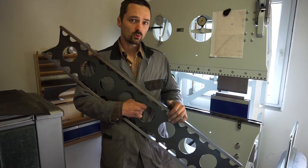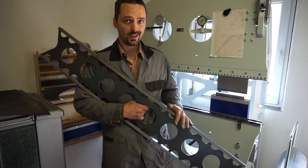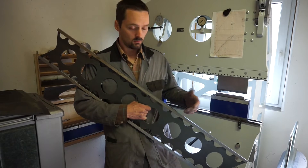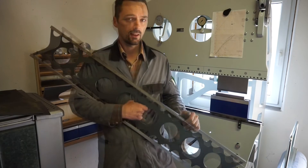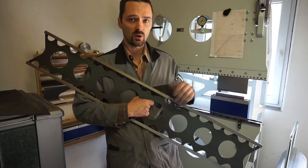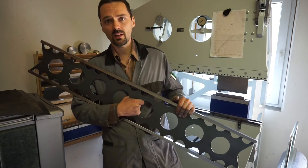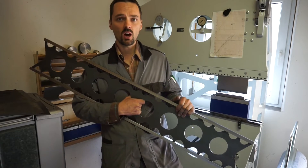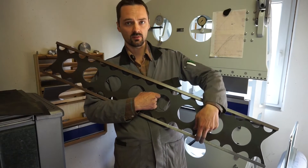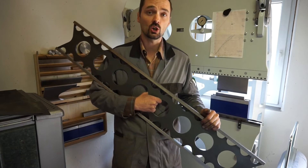It took me roughly two days to make the straight edge, however only one surface is scraped. I think it is fair to say that the straight edge is made against common practice because it's not made out of cast iron, but rather it is a welded design out of three pieces of carbon steel. So let's take a look.